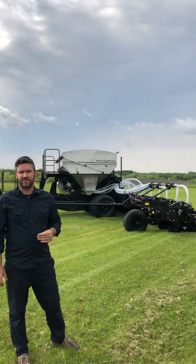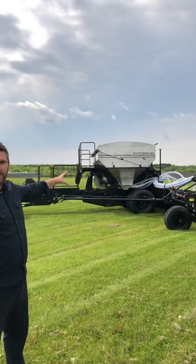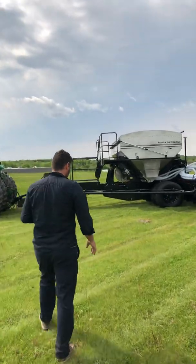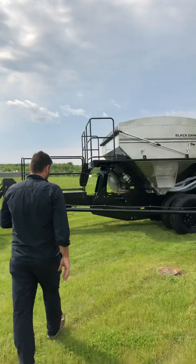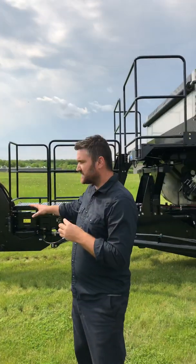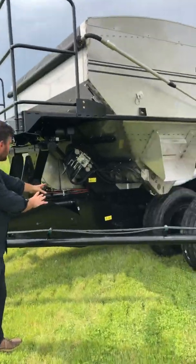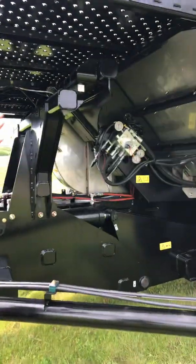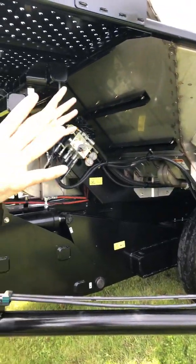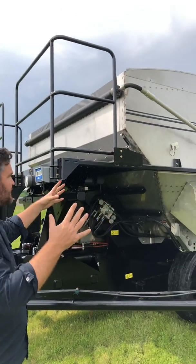To begin with we'll really focus on the 16-30 and the 24-30. It integrates a nine-ton fertilizer hopper on the frame, which is really cool because we've taken a lot of care with this design in order to manage the center of gravity to prevent a negative tongue weight condition. This is an extremely balanced toolbar — only the slightest, maybe 100-200 pounds of negative tongue weight. The whole axle has been designed around packaging the fertilizer and empowering you to build out this large nine-ton fertilizer system.